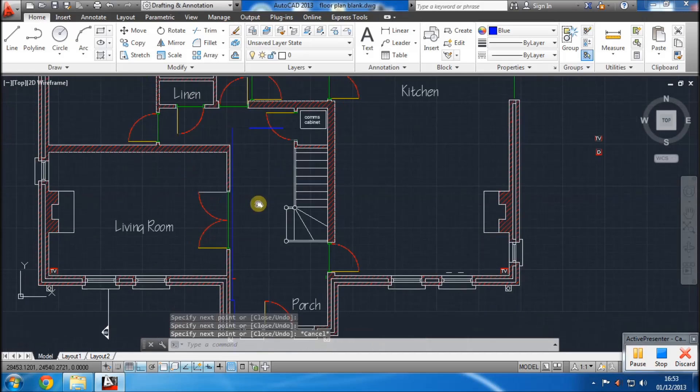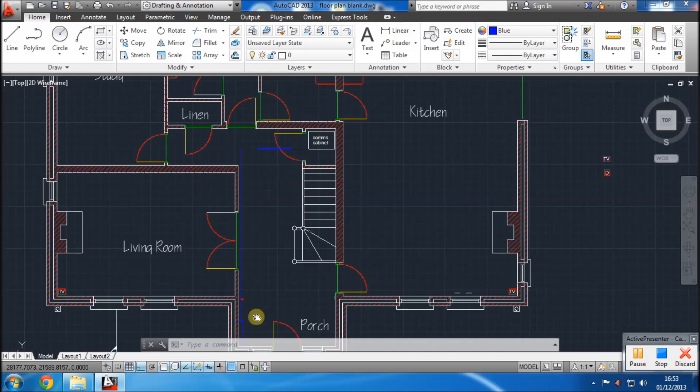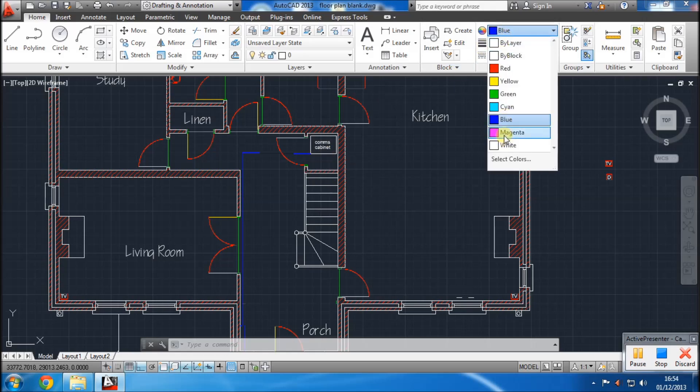From your main phone line, most people's home hub will be located there — that's what distributes the wireless to the entire house. But if you have ten or fifteen internet service points around your house, cabling back to a single phone point won't leave enough room to connect them all. So take two or three Cat5e cables — two should be plenty — into your comms cabinet, and then move your main phone socket from the hallway into the comms cabinet.